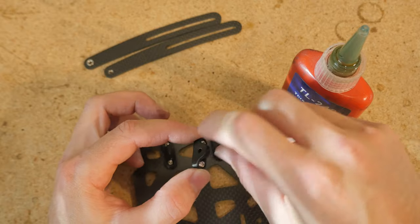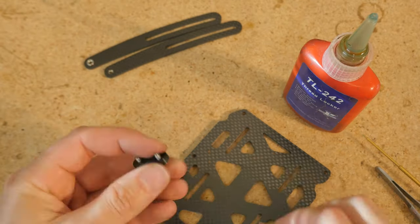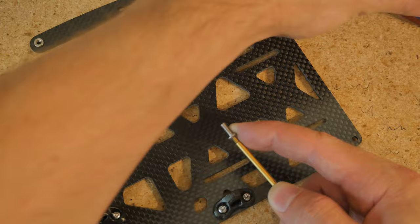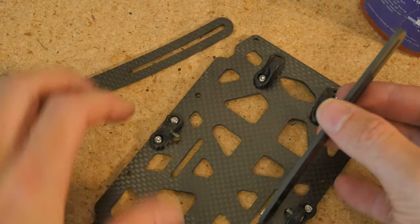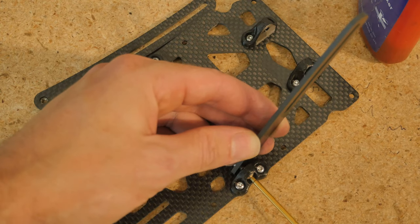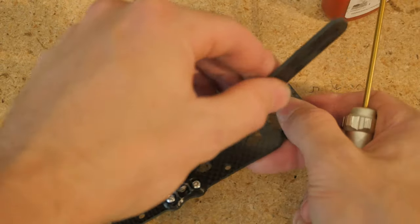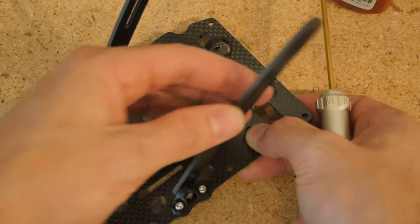For these smaller brackets, we want to have them facing inward as well. Go and find the two 8mm length M3 screws in your kit and use these for the slot struts. Make sure they're oriented so that the curve is facing downward — concave down. This one you don't want to tighten up too much because it's got to be able to move, but you don't want it so loose that it's sloppy. There should be no play — it's got to be silky and firm.